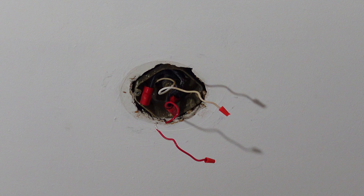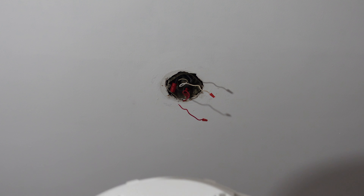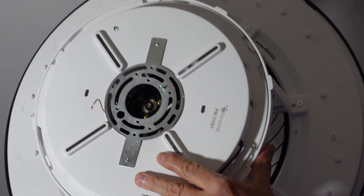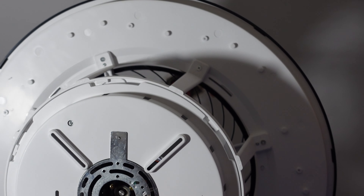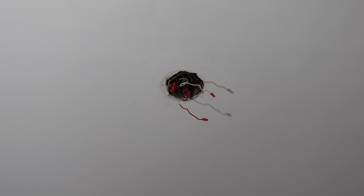There's the hole in the ceiling with the support bracket already in place. There was a fixture up there already, so it's nothing new for a light to be there, but putting a fan there might be a challenge because it's a bit heavier than a single light fixture. So we're going to have to put some supporting bolts into the sheetrock along the sides. The actual fan itself has a pretty wide pattern on the bottom for purposes of mounting it, and we can remove that, which is what I'm going to do now.